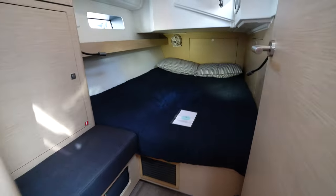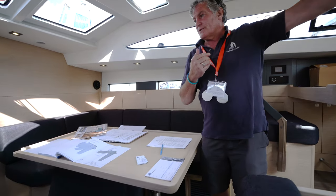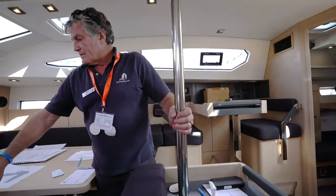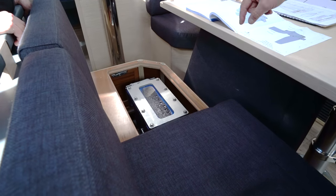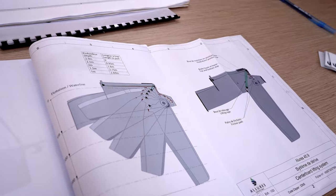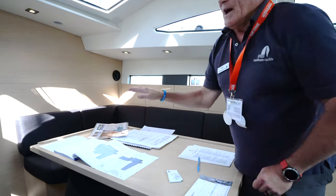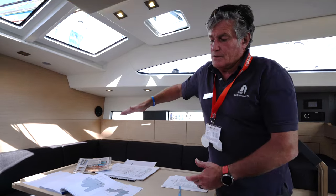The salesman for Allures Yachts was very kind to explain the swing keel system. The centerboard has an inboard clutch with a pit winch right next to it — a green and white line that runs down through a compression post all the way to the back. There's a sight window so you can look at the lines, and if you need to service it, you take the bolts off and access the block and tackle. The drawing from the owner's manual shows the board in the full up position at 3'6", dropping all the way down to 9'6" — a six-foot swing. If you don't have the down line in place, gravity will drop the board down, and when you want to pull it up, the green line handles it at less than 200 pounds of force.